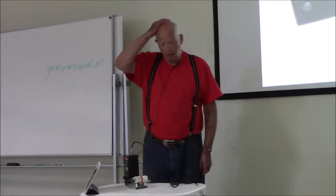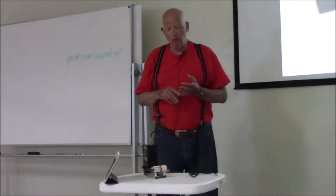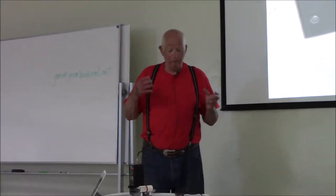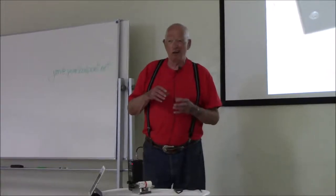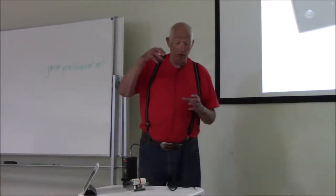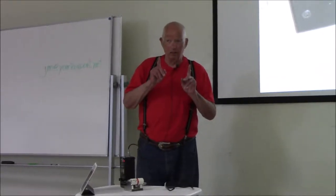And so here we are today, talking about antennas, and what we're going to talk about has to do mostly with wavelength. It has to do with frequency in hertz. It has to do with inductance in henries or microhenries, and with farads, microfarads, and capacitors. Well, what's a capacitor? A capacitor holds the charge. It's like a jar of honey. The electrons are the honey, and they're in the jar. The more electrons you can cram into the jar, the higher the voltage across the two plates, because that's what a capacitor is.